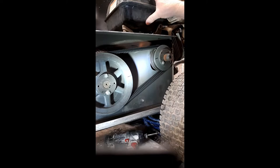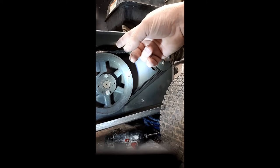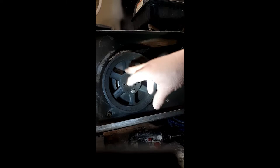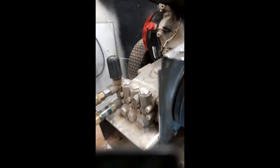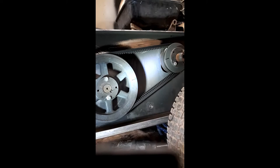As we were talking about, you've got your motor and your pump on the other side, connected through a pulley system instead of being directly mounted to the motor. A belt runs from one pulley to the other. A belt drive pump doesn't give you any more or less pressure than a direct drive — this pump is actually a 4,000 PSI pump and it's the same pump used on a direct drive. The only difference is the belt drive pump has an external shaft to mount the pulley, whereas a direct drive pump has a female coupler that slides onto the motor shaft.